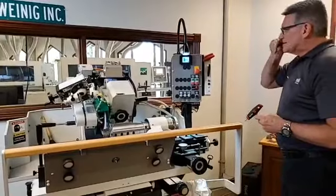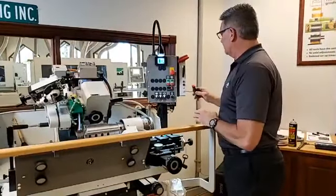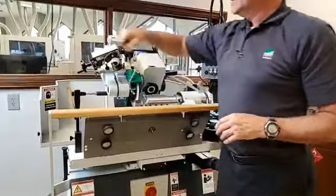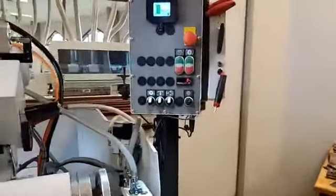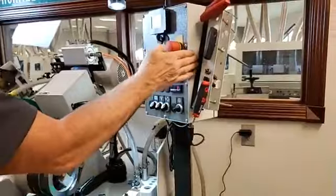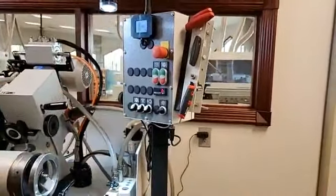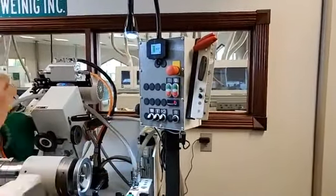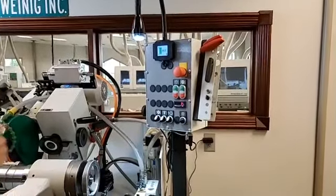Super, super important. So some of you may notice a few things on this grinder that are a little bit different that you may have dealt with. And one of them is simply this tool caddy. It generally comes on the machine mounted up over here, in the sloppy, messy area back there. It's just getting wet. There's all kinds of stuff getting on our tools, and then they're sticky and hard to handle. So very simply, go to your local home improvement store, buy a magnet, put it on the side of this unit, take that tool caddy off and mount it over here. It's just a magnet, so if somebody bumps into it accidentally, they're not going to tear their shoulder open. It's just going to fall off at worst. So that keeps all of my tools right here handy. Again, so I'm not running around the machine looking for stuff, because not too many people have a very long arm and can reach clear back to that factory position of the tool caddy.